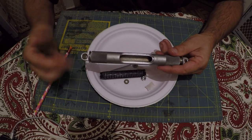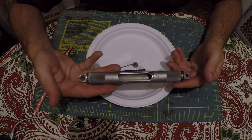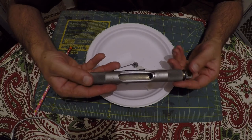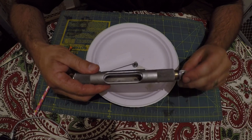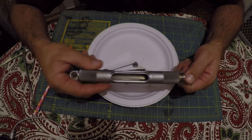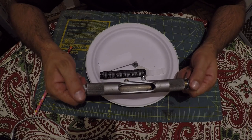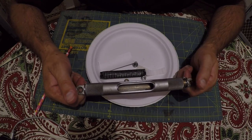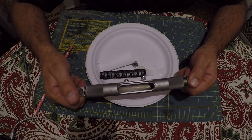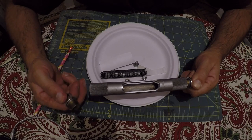If you're working on one of these, you're going to have a broken vial inside, so you've got to disassemble the whole carrier. It's easy enough to get it off the base. What you'll need to do is lock one side in a vise and get hold of the other side with a pair of pliers — try to use something that'll protect it, like leather. Pull it apart; one side is always a little tighter than the other, so that side will come out first.